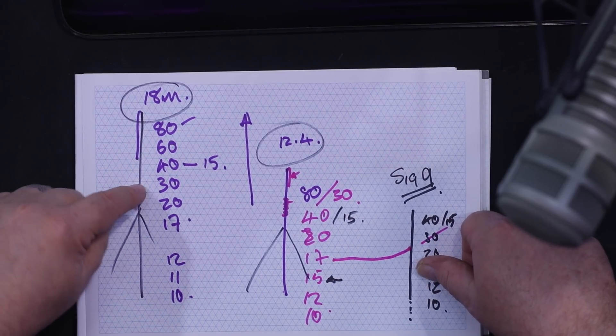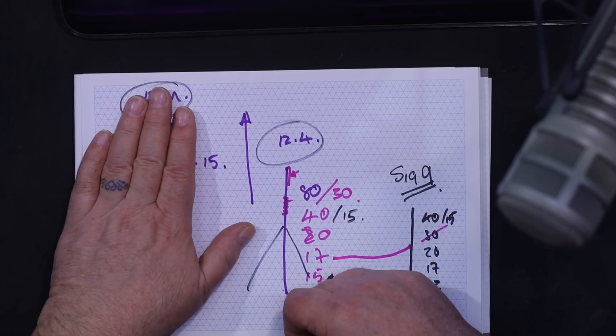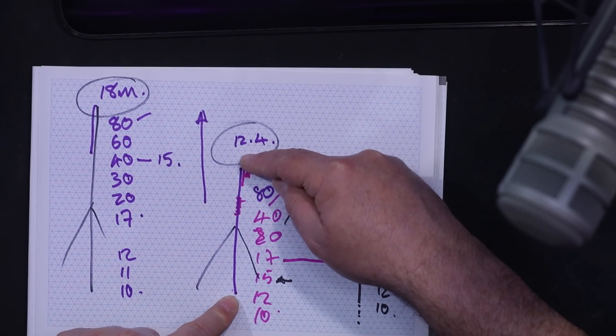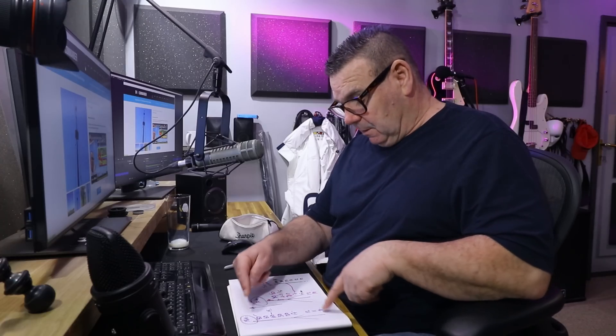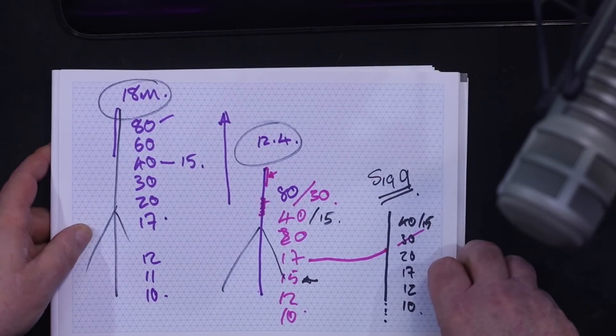The real benefit of going all the way to the 18 meter Signature is bragging rights — 80, 60, 40, and 30. If you're a nighttime DX hunter on 80, that's your antenna, especially if you also want 60. Otherwise you can work with the Signature 9. I did CQ WPX and my biggest band on the 9 was 80 — I made over 100 contacts in a couple of hours. It's a shorty 80, not a shorty 40, so I might lose one or two dB, but it works.